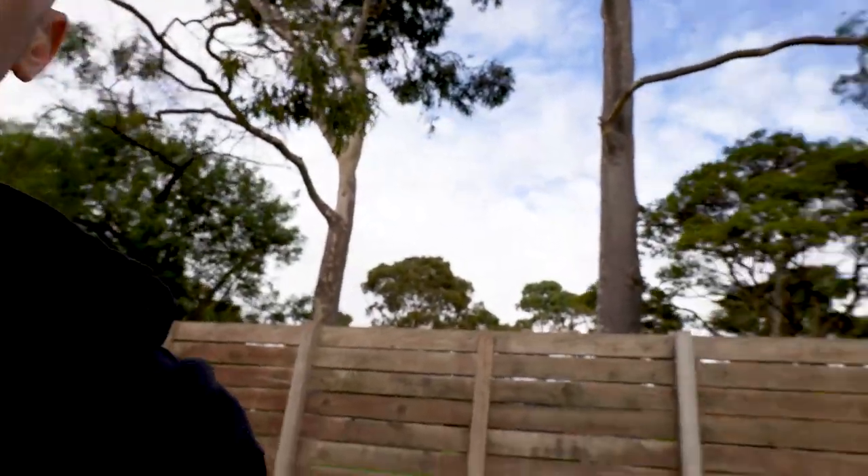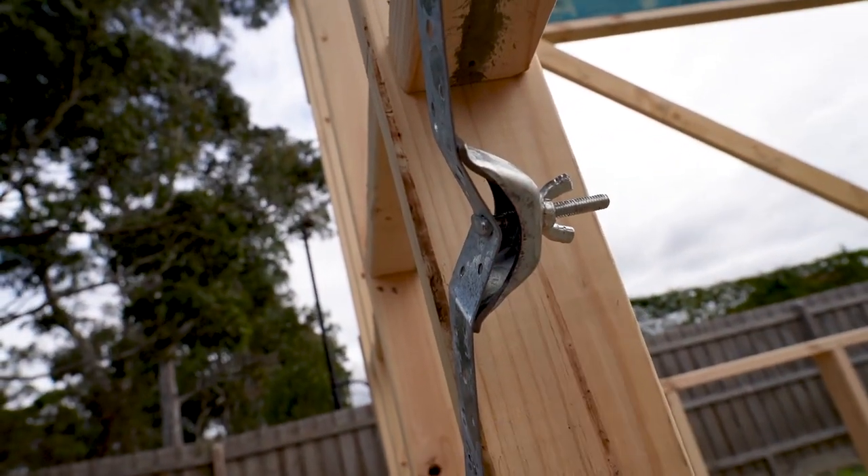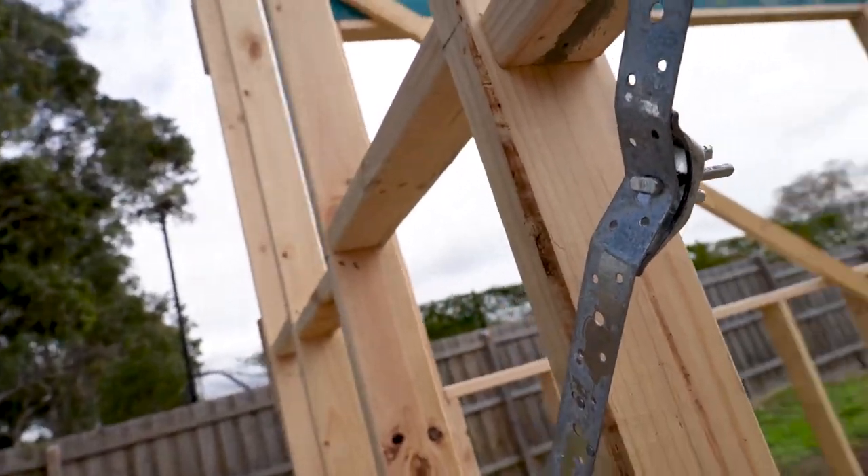In my opinion you shouldn't use the full throat of the tensioner — see how there's still a gap back here, that means it was properly tight before the tensioners went on. I'll go over installation in a later video, but this gives you a rough overview. I'll also link the standards if you're curious about bracing. The standards do tell you in a cryptic way how to figure out what bracing goes where — if enough people are interested I'll do a video on that, as it's part of getting your builder's license.